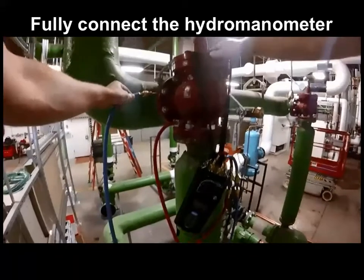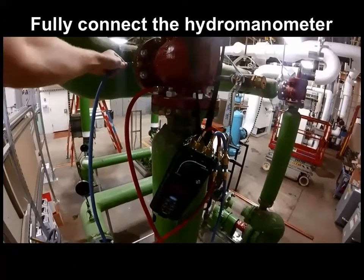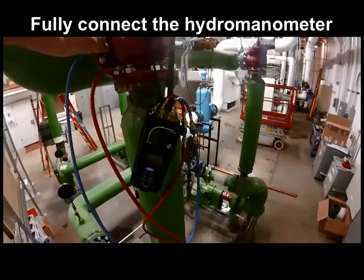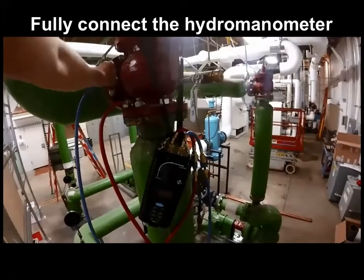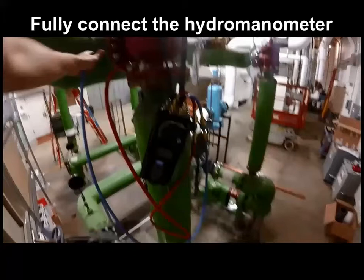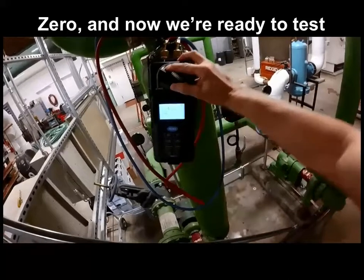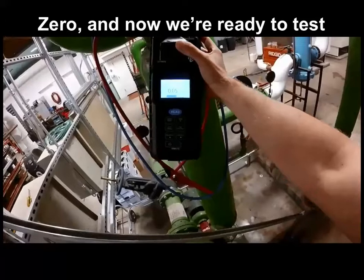Now you're ready to connect the low pressure side. Just as you did with the first probe, gently slide the hydro-manometer fitting through the test port and hand tighten until secure and without leaks. You don't want to force the probe — it should slide in fairly easily past the rubber boot that keeps water from spraying out, and you should be able to screw it in to hand tighten. Make sure the hydro-manometer is powered on, and if you moved the selector switch up to measure, return it to bypass to calibrate or zero the unit.